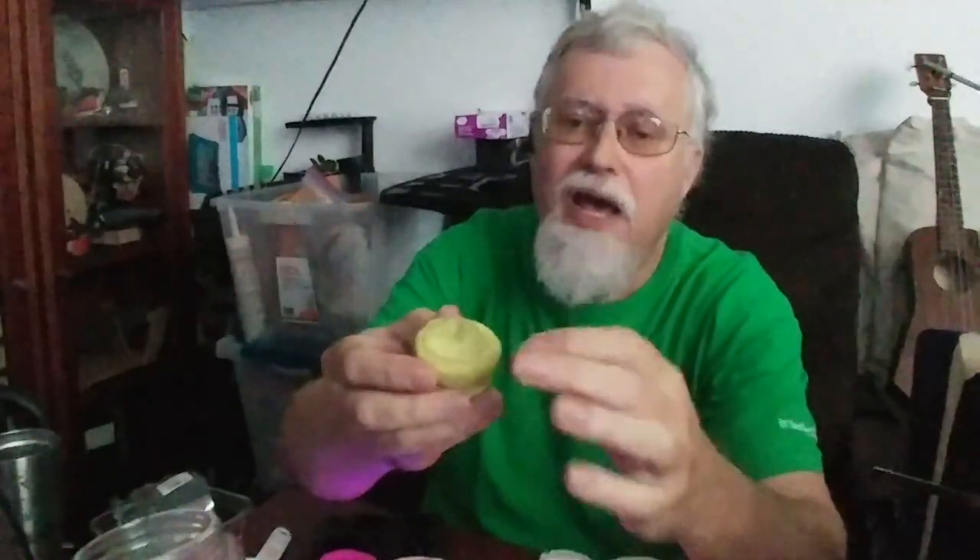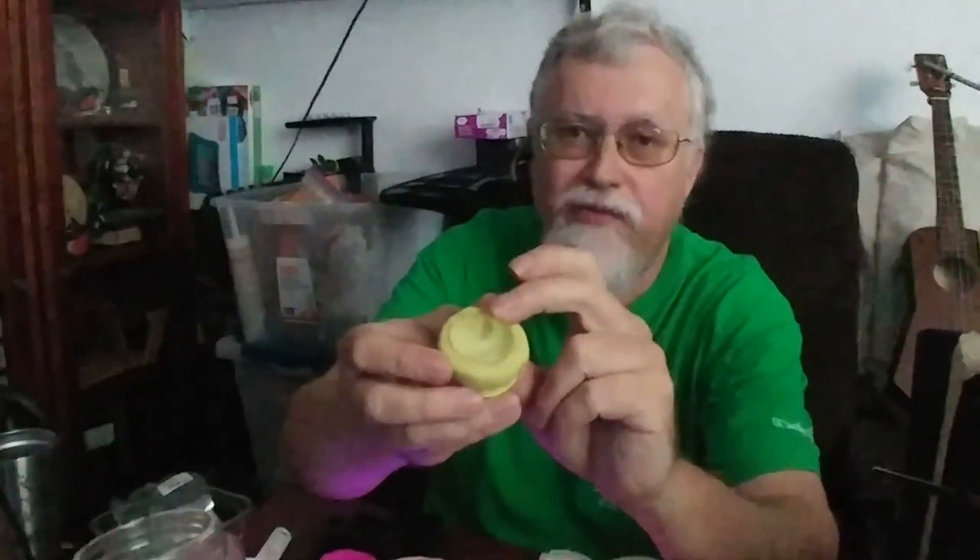Now that I've got that nice big lump, I'm going to grab my LED and just hold it right behind the head. You don't want to hold it too far back because when you push it in you might bend the leads since they're pretty thin. Just hold it right behind the head and push it in, push it down far enough that it's not going to come back out. Then you can push the plastic up while it's still melted in order to hold it in place.